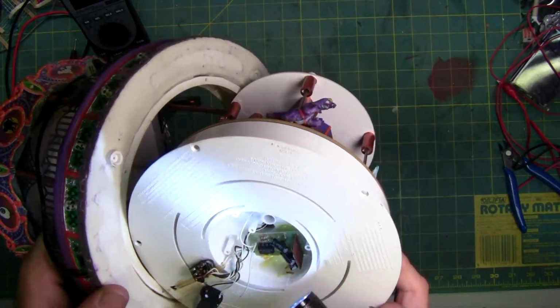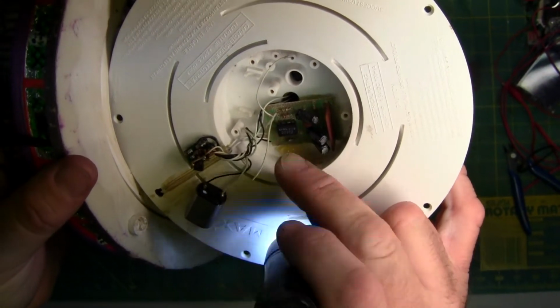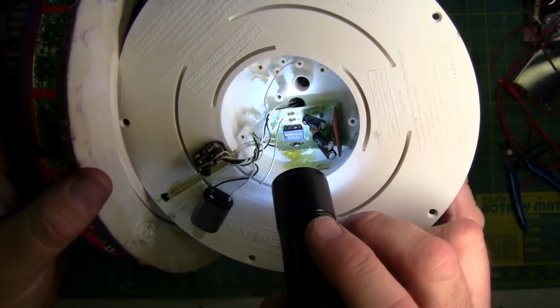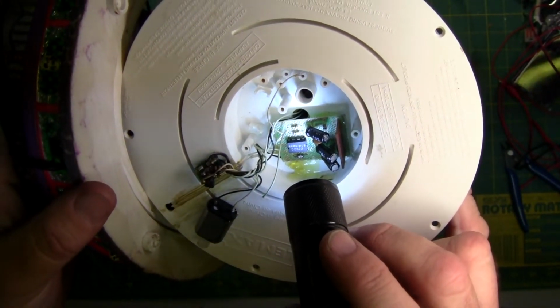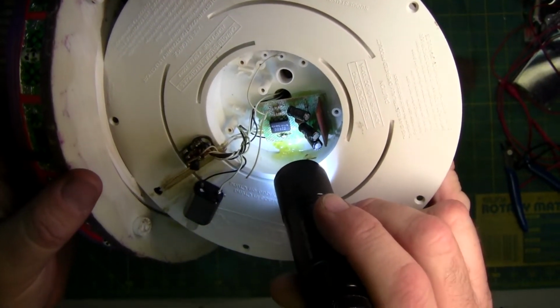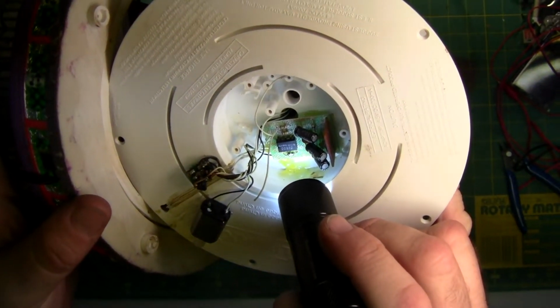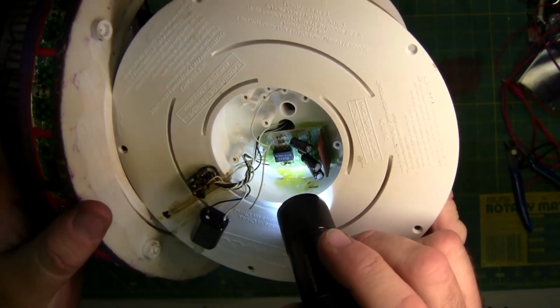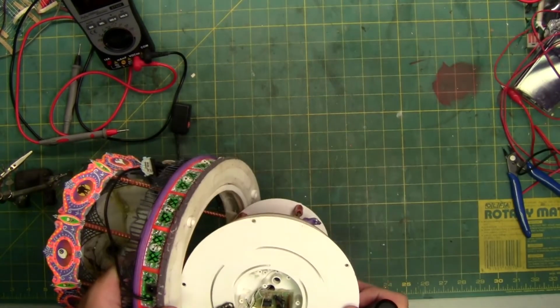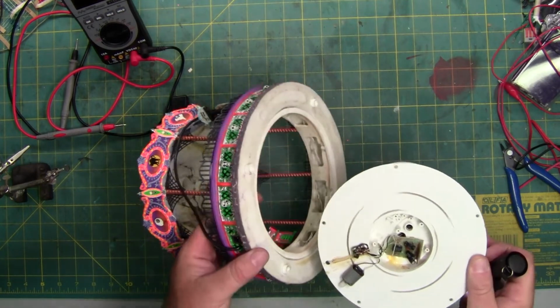It's a short. The other resistor is the bottom side of this chip. This chip is the sound chip. You got two resistors right there that are beautiful colors. You can see the colors are fine. Then you got this little bad boy. That's got a hole blown through the side of it, and it's kind of silver in color because it burnt all the coating off of it. I have no idea what that resistor is supposed to be as far as resistance wise.